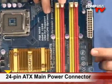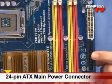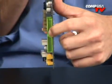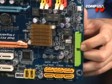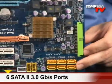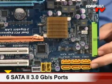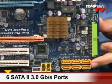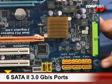Over here you've got a 24-pin power connector and a floppy disk drive header. Moving on, there's an IDE header for your legacy drives, in case you have an old hard drive you want to use. You also get six SATA ports — all three-gigabit-per-second SATA ports — and they support RAID 0, 1, 0+1, and 5. All of those right on board.